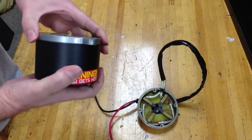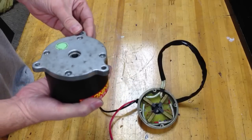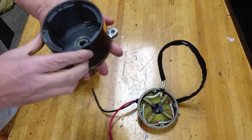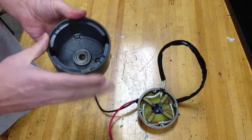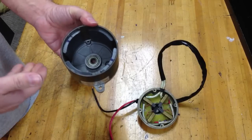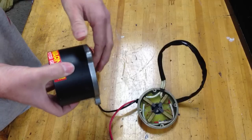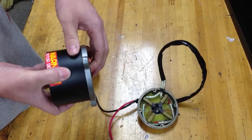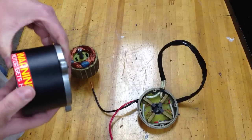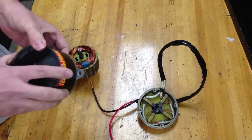For my use in the live diesel electric ride-on project these motors are going to be for, I wonder if that's going to be a problem. At least I'd have to make sure all the motors on the trucks are in the same orientation, so that when the locomotive is moving forward, all the motors are turning the same — clockwise or counterclockwise — in relation to the electric motor. So if they're all advanced, they're all pulling advanced, and if they're retarded, they're all retarded. Maybe it doesn't play a part.